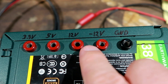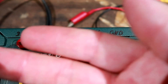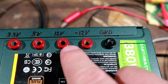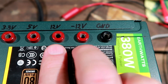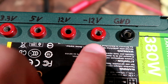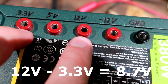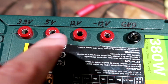You can also do combinations. You can connect something to the 5 volt and 12 volt, which gives you 7 volts — just the difference between the two. Plus 12 volt and minus 12 volt makes 24 volt. Minus 12 and plus 5 gives you 17 volts between those two. Or you can combine 3.3 volt and 12 volt. As you can see, you can create many, many voltages as a combination of the ones you already have.